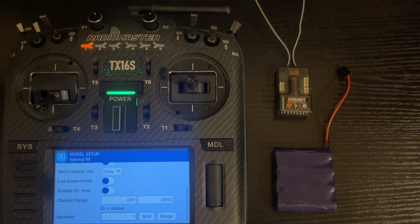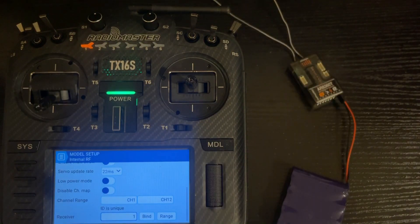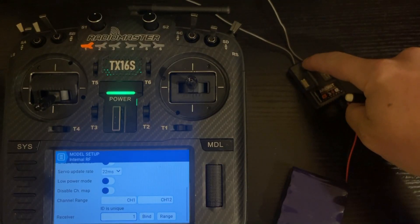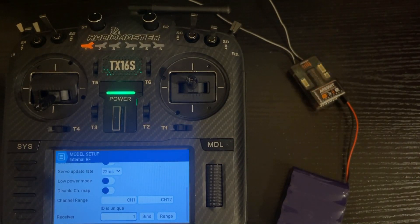Click outside the screen and you'll notice the Bind button appears. Now we're going to power the receiver up. Once the receiver is powered up — whether you're using a receiver battery like on the test bench, it's a fuel-powered plane, or the ESC powers the receiver — you can push the bind button and that will make the receiver flash. Once the receiver is flashing it's in bind mode. Push Bind on the radio; the radio will make a chirp and when the light goes solid on the receiver, it's bound.